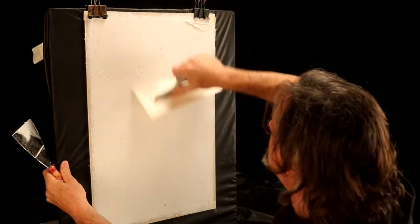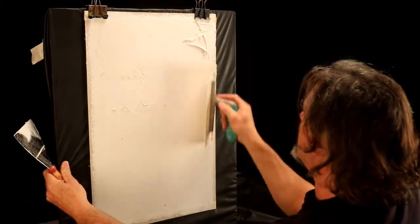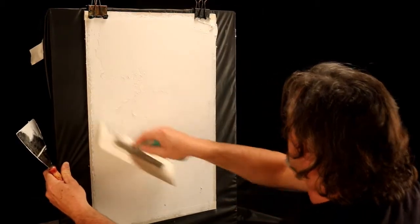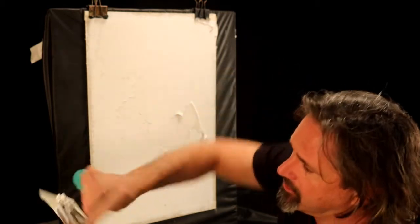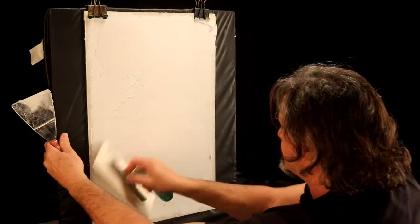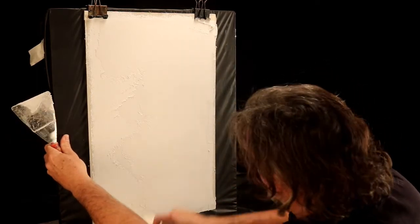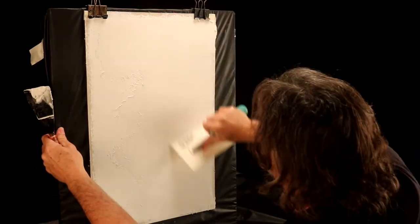This is a Pavon plastic trowel and it's a very nice trowel. What I like about this one is it has no color put into it — it's 100% natural. Now, see how the plaster rolls around the back of that trowel? It's just a characteristic of the product, nothing to do with the trowel — this is the heavy product, and it just slips around the back of that beveled edge. So I'm putting it on, you can see I'm putting some pressure to it, putting it on, smoothing it out, and cleaning my trowel with my spatula every so often.